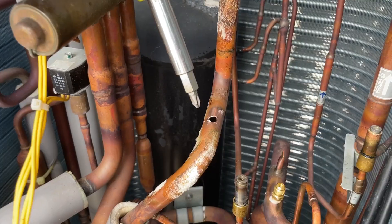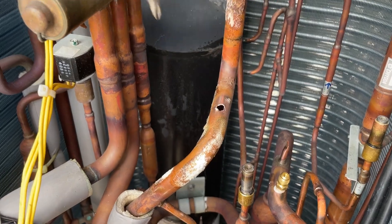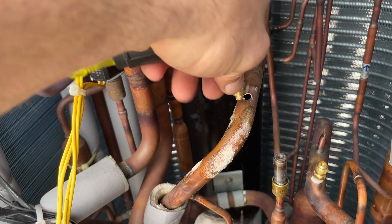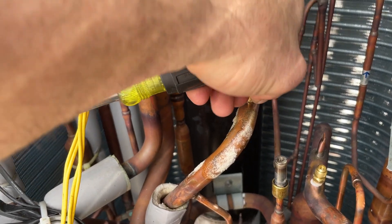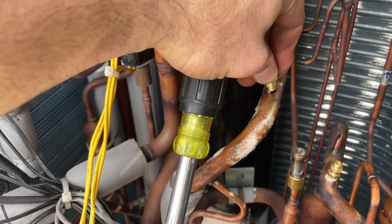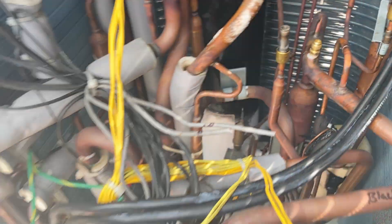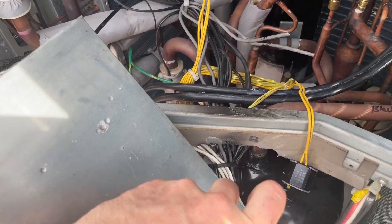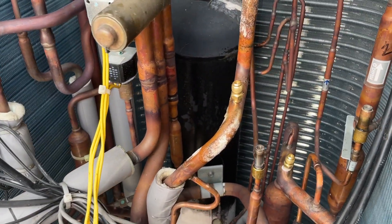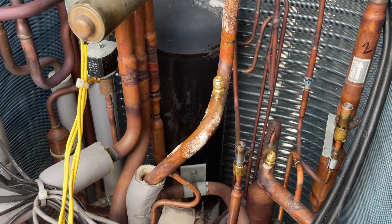This one here is being a little stubborn, and with quarter-inch holes I've found that just a little Phillips bit — the filming is very difficult in this unit — just a little Phillips bit, reaming it out a bit, is all you really need. Now, this is brass, so you do need to use flux on that. It's not like brazing copper to copper — you need flux for brass. And I'm probably going to use a safety-silv just because of the way it flows and this being a tight area.